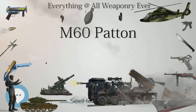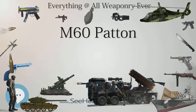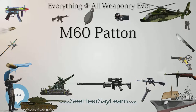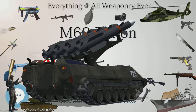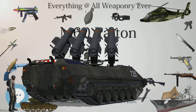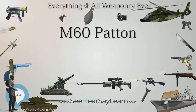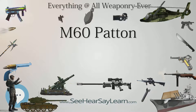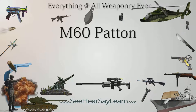Most of the M60A2 tanks were rebuilt as M60A3, or the hulls converted to Armored Vehicle Launched Bridge (AVLB) vehicles. In 1978, work began on the M60A3 variant. It featured a number of technological enhancements including smoke dischargers, a new flash-lamp-pumped ruby-laser-based rangefinder (AN/VVG-2) usable by both commander and gunner, an M21 ballistic computer, and a turret stabilization system. Late-production M60A3s omitted the commander's cupola, lowering the vehicle's relatively high silhouette.